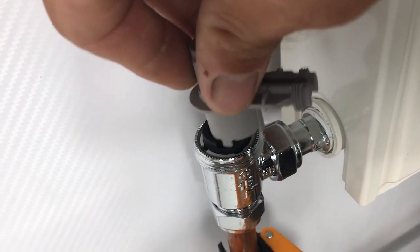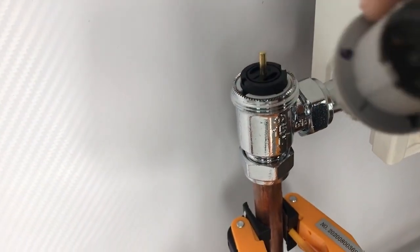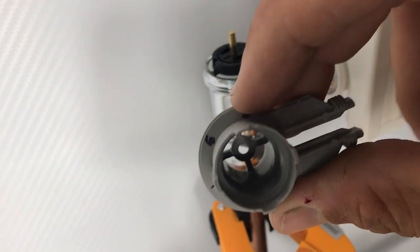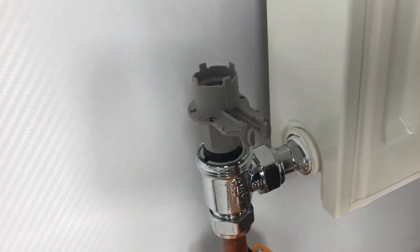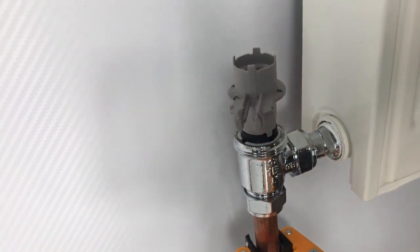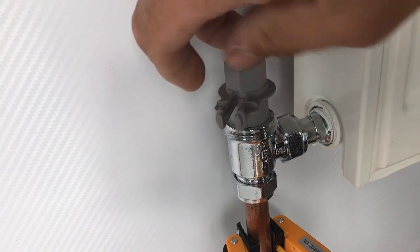To increase resistance and achieve balance on the valve body, start by loosening the clamp ring with the pre-setting tool, then flip the tool over to turn the valve insert in a clockwise direction. The numbers on top of the insert correspond to the size of aperture — position six is wide open, turning clockwise to position one gives the smallest aperture, and positions two through five progressively get larger back to six. Once you've made the setting, flip the key over and do up the clamp ring. Always turn clockwise so that if you catch the clamp ring while turning the insert, you'll only ever tighten it, not loosen it.